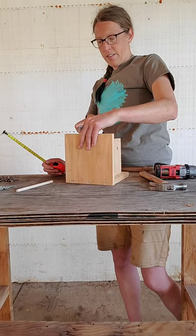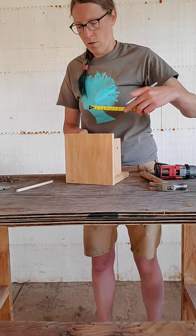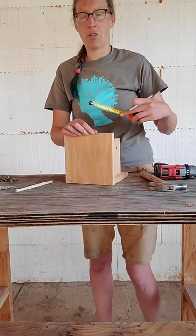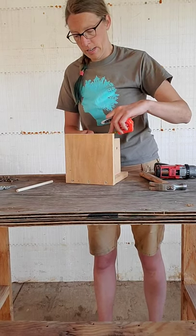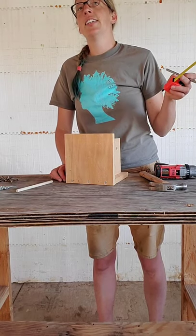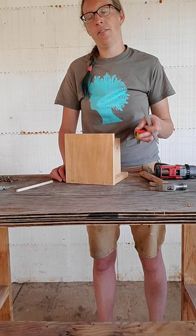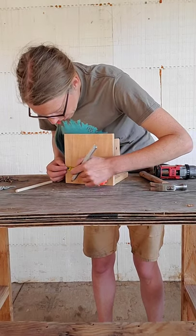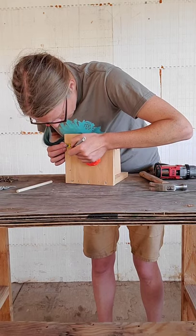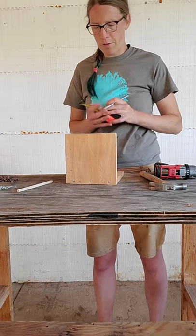And so before I take that down, and we know we're going 1/2 inch in, so we need to add 1/2 inch plus 3/8, since 3/8 is 1/2 of 3/4, so we want to nail it to the center of the wood. So 1/2 inch plus 3/8. So 1/2 inch would also equal 4/8. So 4/8 plus 3/8 is 7/8. So I'm going to look at 7/8, make a mark, give me that up here. And that is where we are going to drill holes for this back piece on this plane of the roof.